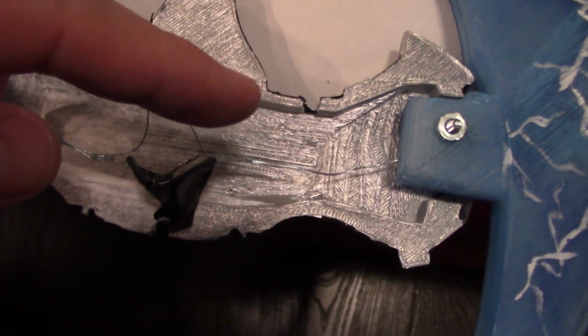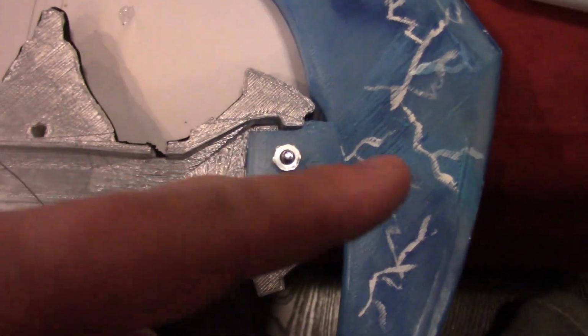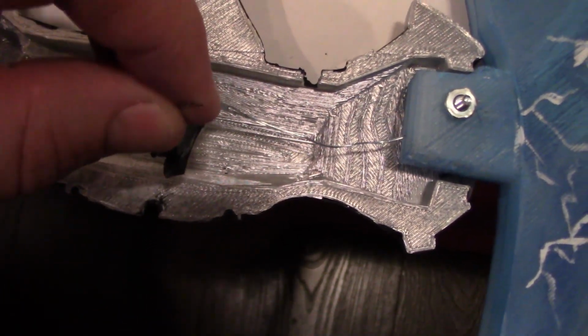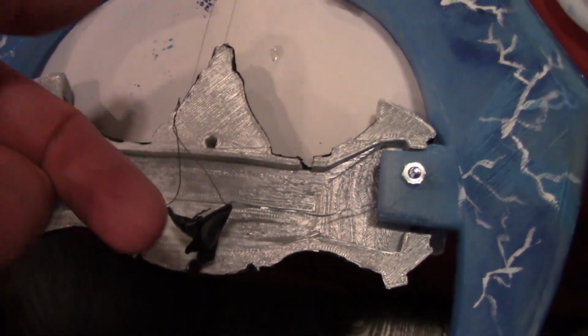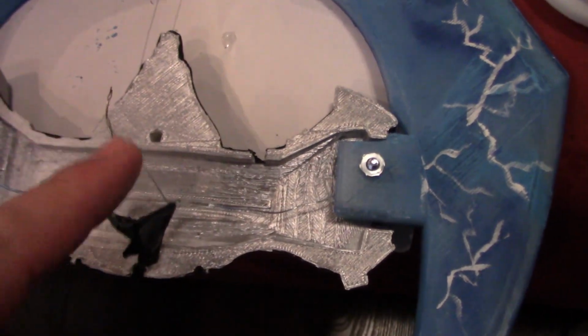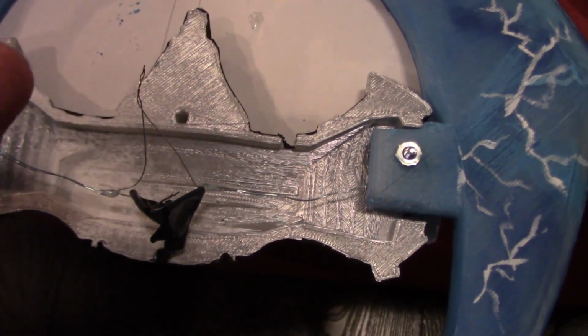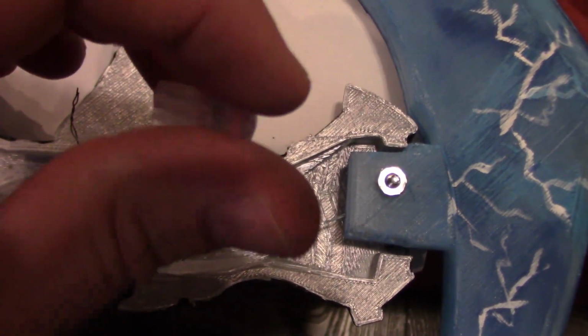So you know, when you hook up a battery to a light, which is a diode or LED in this case, it only turns on one way. So if you put a battery like this, it might turn on, and if you put a battery on like this, it might not. So before you twist it together, however you fasten it, I just twisted it together, I'm going to use these little scotch locks that I have to basically insert everything into. You press this down, it'll connect it all and seal it and everything for you.